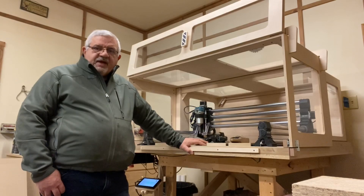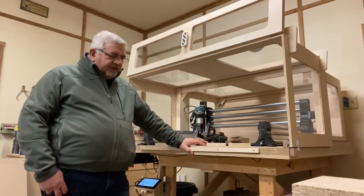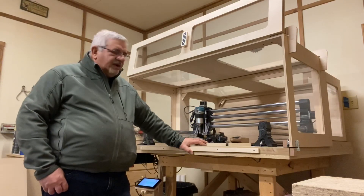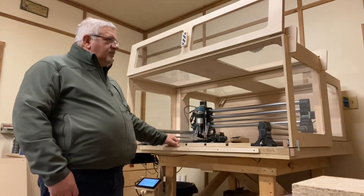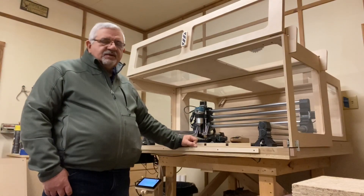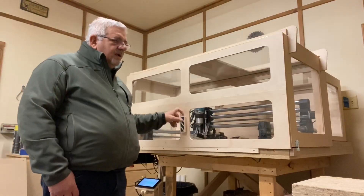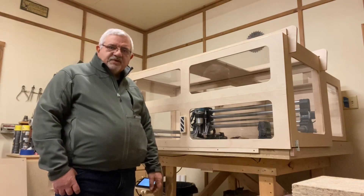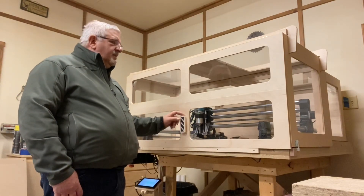This project is pretty much done. I did want to point out that I downloaded a decibel reading app on my phone the other day and decided to check the noise reduction with the enclosure. I turned the router on and it was reading between 86 and 88 decibels; then I shut the door and it came in at about 71 to 73 decibels — roughly a 15–17 decibel reduction, which isn't bad. I built this primarily for dust containment, so the sound reduction is a side benefit for me.